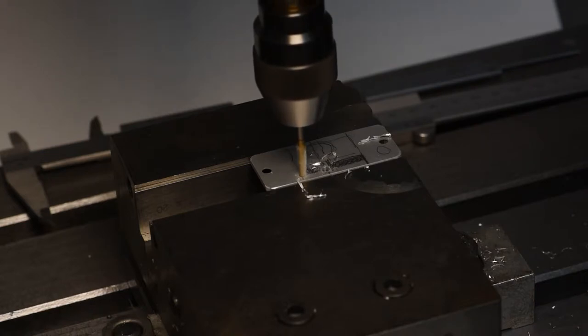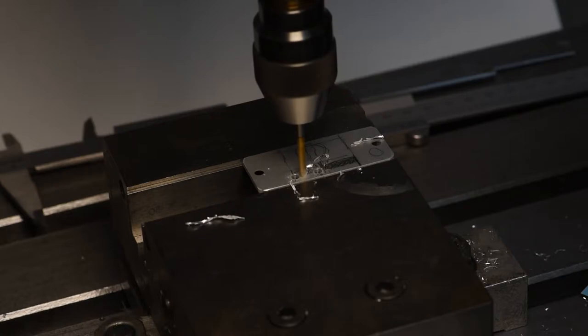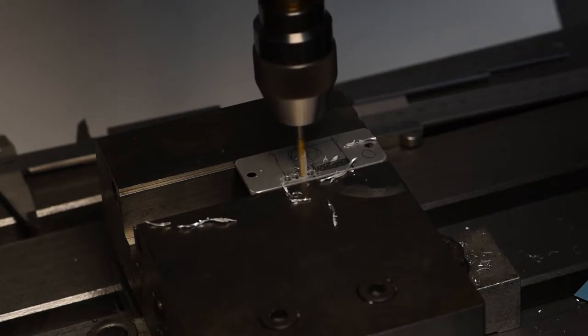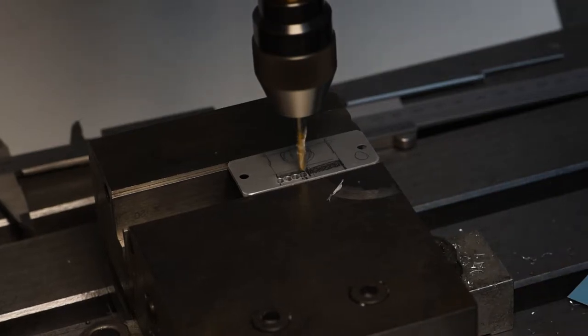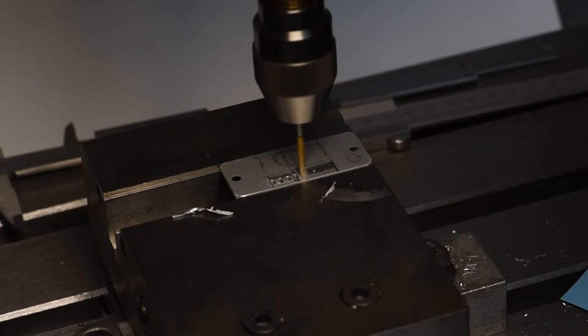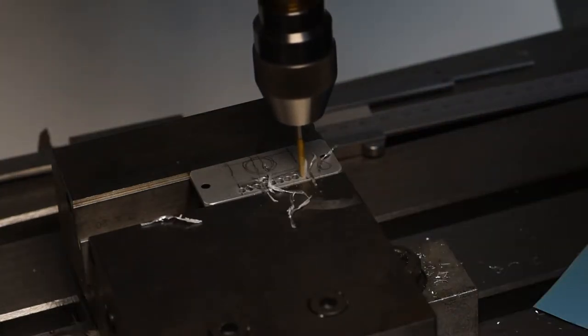As you can see, again, we're not just swiveling with a drill head through the aluminium, but we are making an array of holes which we can then connect and smooth out. This is quite time consuming, so we'll speed it up in a bit. And here we are with the last of the constituent holes of the slit.